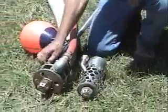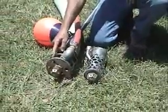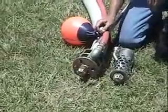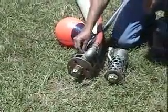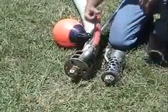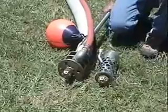When you're using this alternate head with the larger 1.5-inch diameter square holes, there is an element of risk that you can pick up an oblong shaped rock that can fit through the openings of the head yet not be able to pass through the pump.